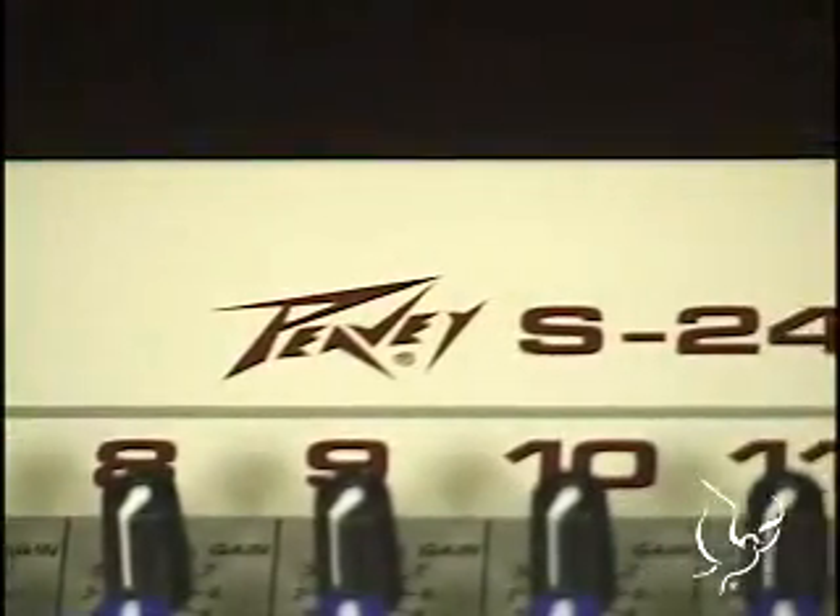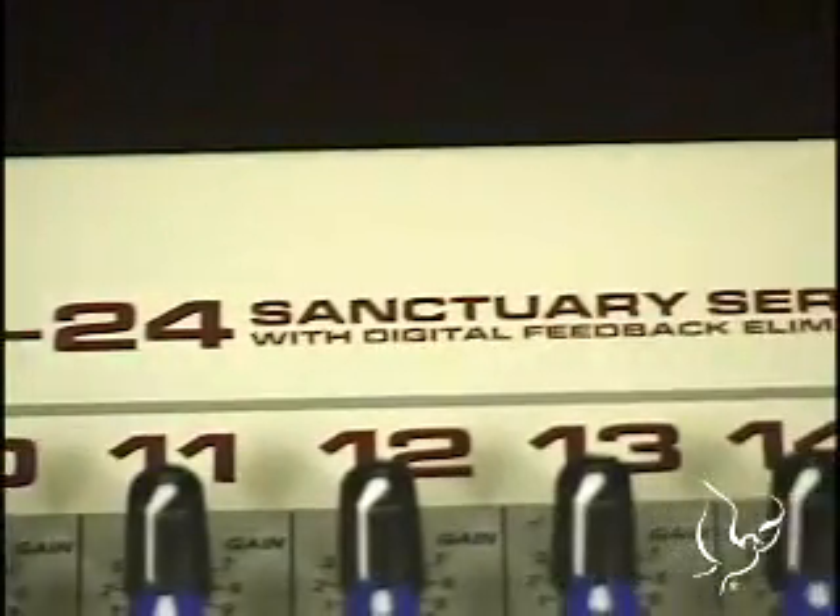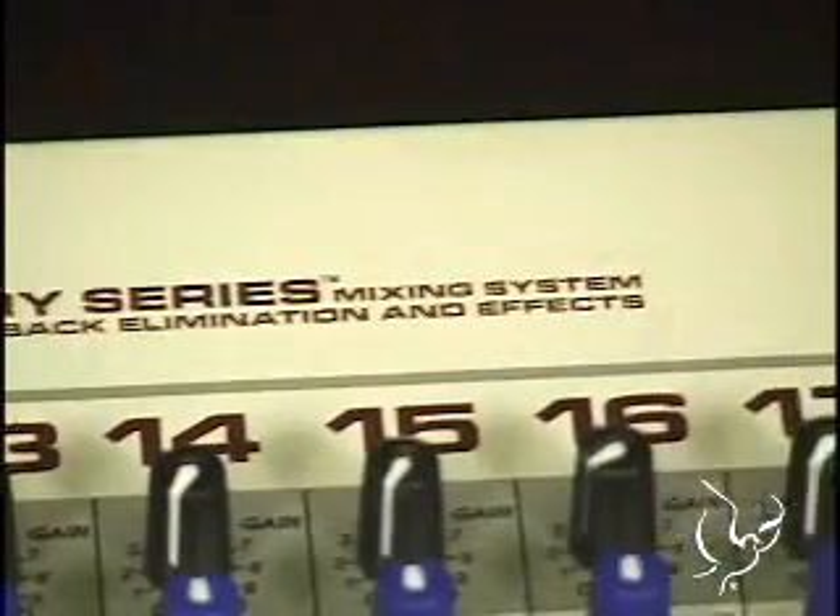So if we have more than two microphones, how can we solve that problem? It all works the same. It works in our smaller systems with up to four microphones, and in the S32 we have the provision for eight automix microphones. It looks at the signal on each microphone, gives the gain to the microphone that's in use, and turns down those that aren't in use, just as an operator would do if he was really fast and could anticipate who's going to be talking next.